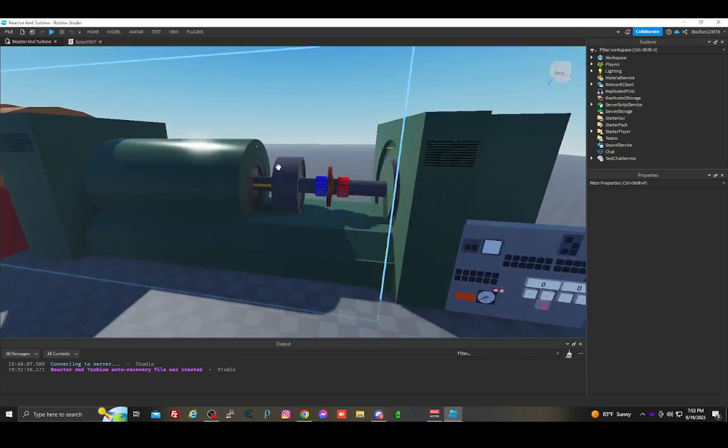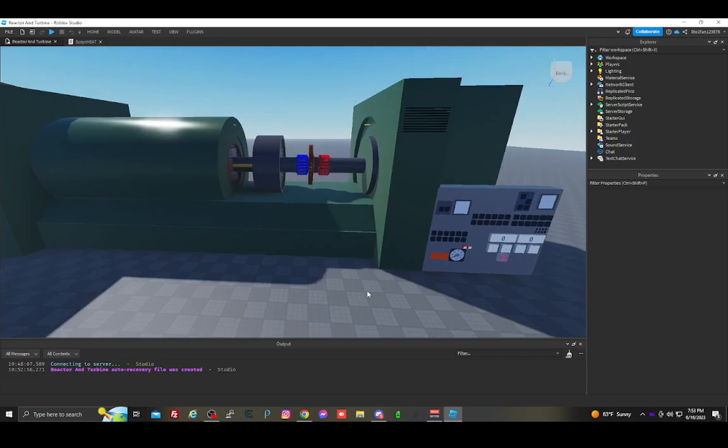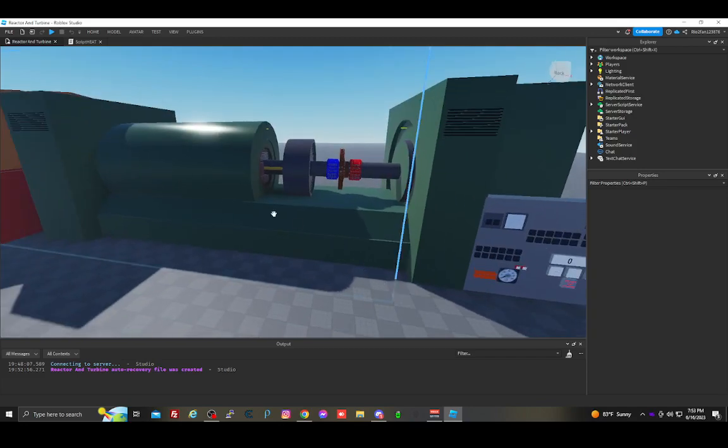the magnetic field in the generator, because if you don't excite the field, it can't generate its magnetic field, and therefore if you don't have a magnetic field, you can't generate any electricity. So you need to keep the field excited. So there must be a big capacitor or something down the line of this, unless it's a self-exciting generator.